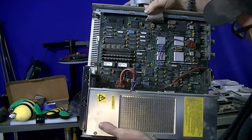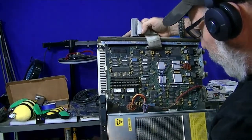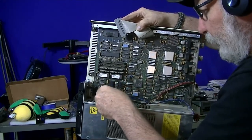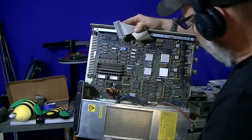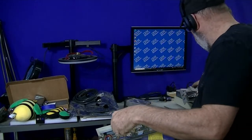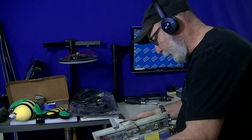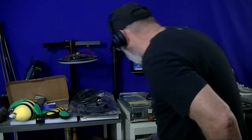But yeah, how full size that board is, so much bigger than the later models. It even has a negative voltage regulator, like the Twin X port, required for Micro Channel, because Micro Channel didn't have a negative 5-volt DC on the bus. But that's a good view of what that board is. I want to dust off everything and put this down. So hopefully that was a good, informative little section of what these units are and how IBM was designing them at the time.